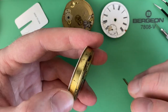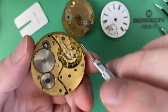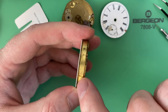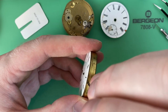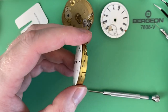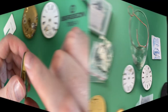With these old pocket watches, let me show you another trick for how this dial comes off — there are no dial screws accessible on the back. They're on the side of the movement. This actually has a ring that goes around the outside of the movement, and this whole thing will pop off. There's a mark where the dial feet screw is on the movement — you can see it marked here. Look at that: the dial feet screws are on the side, again 180 degrees from each other. Give that a little turn and that'll pop right off.